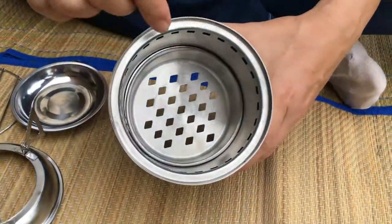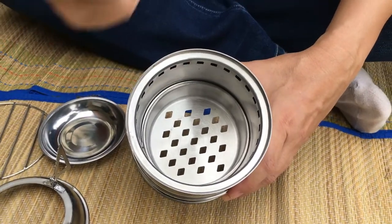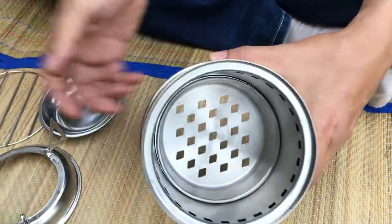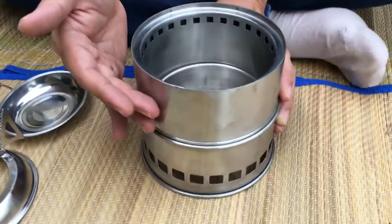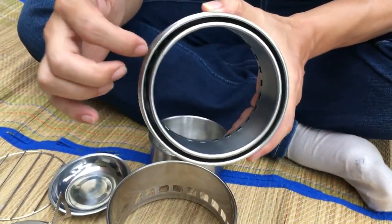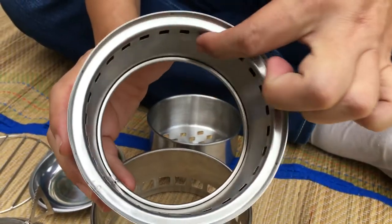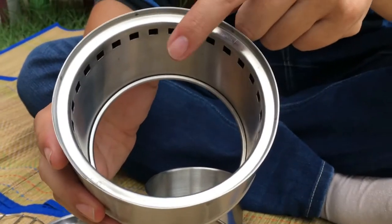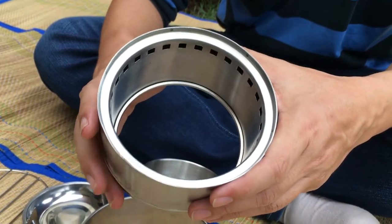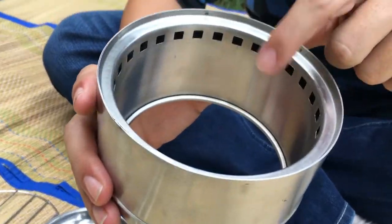How does it happen? When we begin to burn the wood inside the gasifier stove, the wood will gasify and turn into hydrogen — that's the main thing we want to burn. The hydrogen is drawn downwards through the perforated base, then moves up from the side of the stove through a double wall. The gas moves up through this double wall and comes out through these holes at the side. So when the hydrogen comes out through these holes, that's where it burns and gives you the heat. You will see that the wood itself does not burn, but rather it is the hydrogen coming out from these holes that burns.